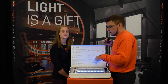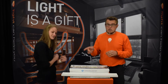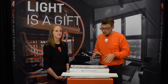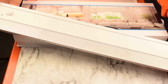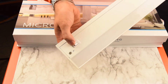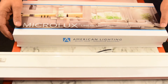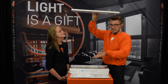American also has linear products for under-cabinet lighting. You can use tape light for that, and we do it a lot to custom cut to the right length, but if you want easier installation you can buy a product made specifically for under cabinet. This standard option looks like under-cabinet lights have always looked — used to be fluorescent, then halogen, now it's LED. It's line voltage, has a switch, and has openings on both sides so you can link multiple units together to make a row.